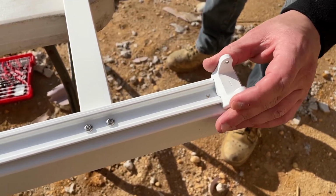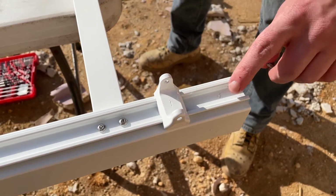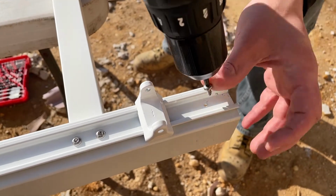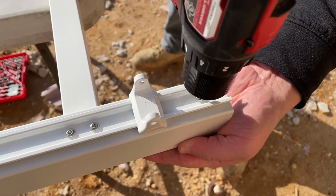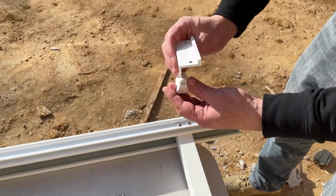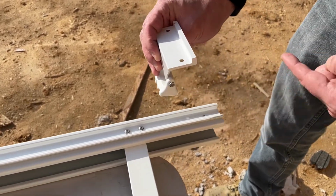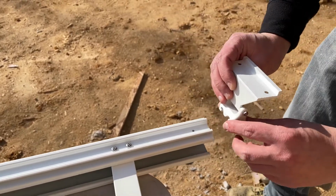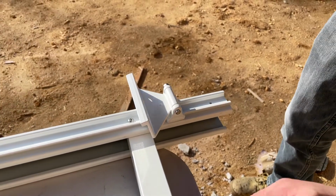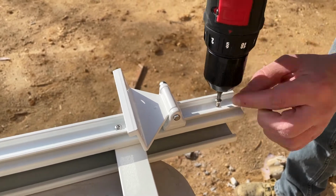On the top rail, slide the loose rail brackets over the aluminum at either end and drive a retaining screw at the pre-drilled hole to prevent it from sliding off. On the bottom rail, slide the assembled rail brackets on either end, making sure the wall bracket flange faces away from the door frame. Drive retaining screws to prevent them from sliding off.